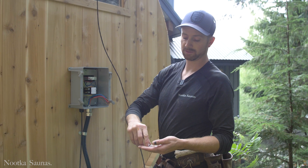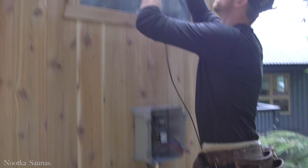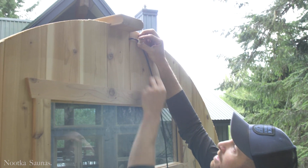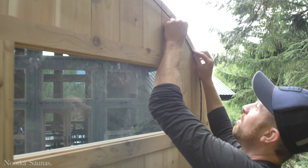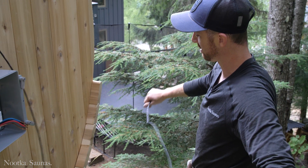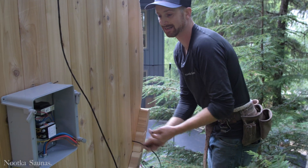You're going to get some cable staples with your sauna. They're going to look like this, and you are going to hammer them in — they're called cable staples. You're going to hammer them in to hold the wire nice and tight to the sauna, putting them in about every 12 inches so it runs around the outside. Then you're going to take the wire and put it back into the sauna where you drilled those holes underneath the back benches, so that it's hidden inside the sauna.